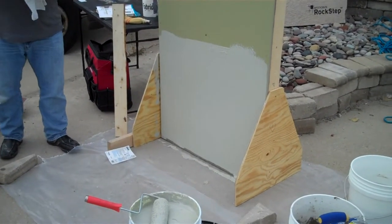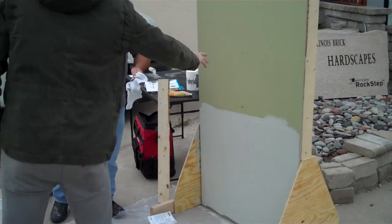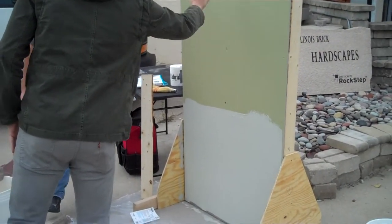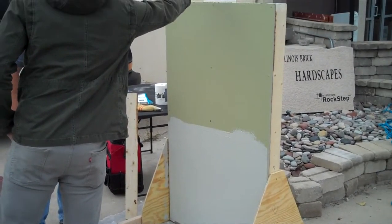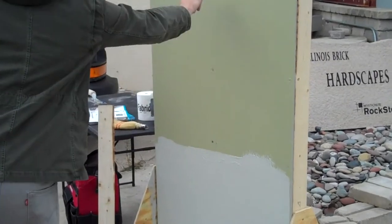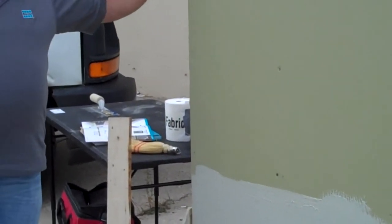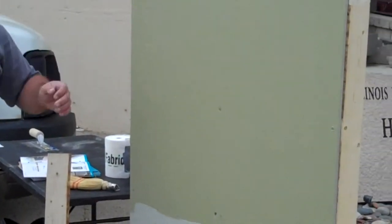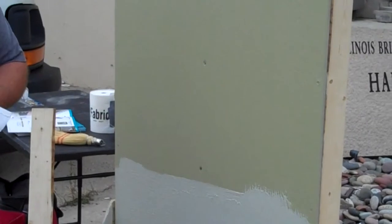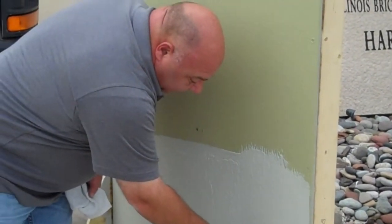Now, I came a little late to the party. So what, if I could go ahead and go backwards. So we have cement board. Yep. And then maybe you use some screws to put them into the studs. Yes. You'll countersink those a little bit deeper. And then we're going to want to put all of our tape. Yeah, not over the screw holes, but seams. So if I have a seam, okay, if it's just a screw hole, I can just cement that little patch. Got it. Okay. And then after tape, this is our air water barrier right over all that stuff. Right.